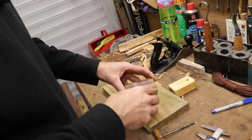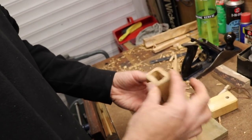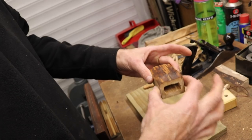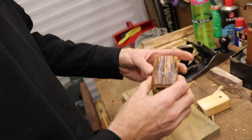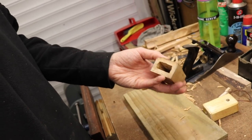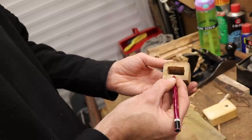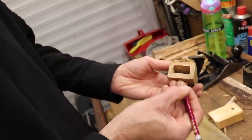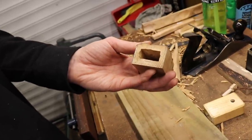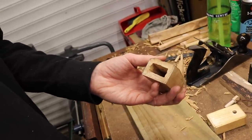And then we can take this out in stages if we like, but while we've still got these, we're gonna knock the corners off, the sharp edges off of this in a minute. But while we've still got these nice straight sides that we can grip in that cross vise again, we can position this fairly accurately, actually set the depth of travel so that the drill puts a little bit of a hole into the backing for the peg to register there, but doesn't come all the way out the back. So we can actually set the depth of travel there. You could do the same thing by measuring it and just putting a bit of masking tape on your drill if you're going to do it by hand.